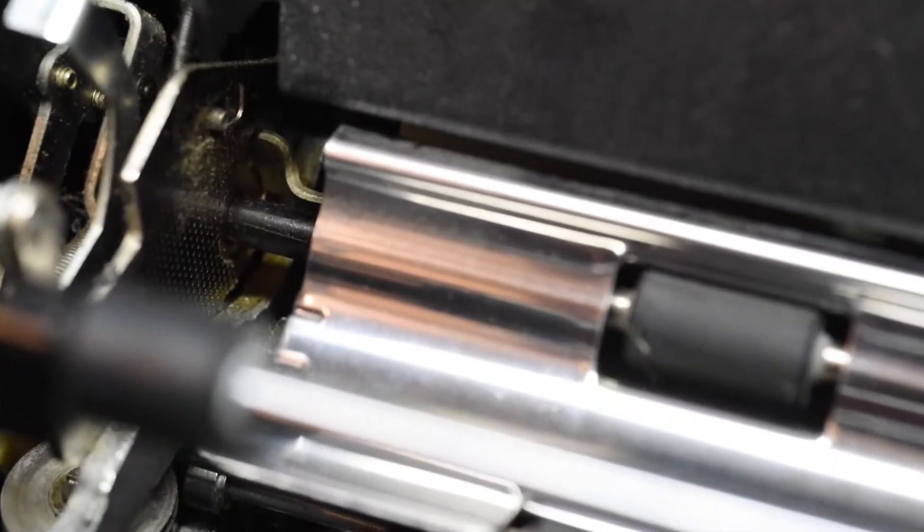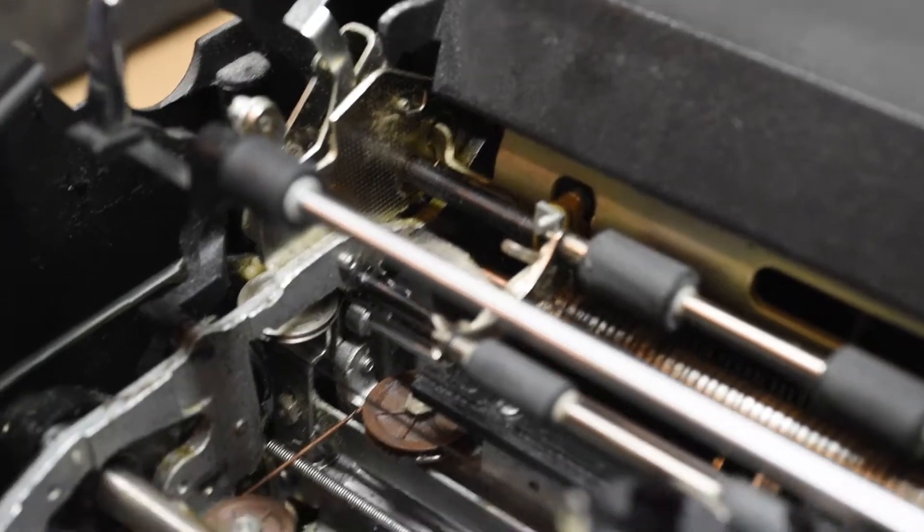The next thing you want to remove is that piece of aluminum. It just comes off — it's really, really simple. It's really, really loosely sitting in there, so just pull it out. The next thing you've got to do is unhook the top cover. Mine's already unhooked, but there's that little tab — there's one on either side. Get a screwdriver in there